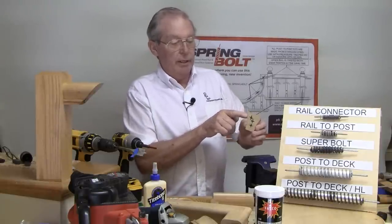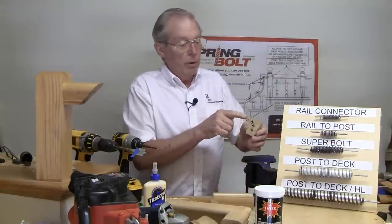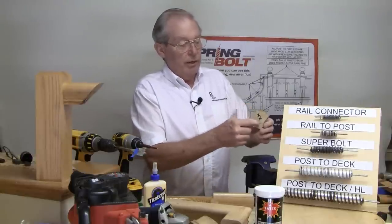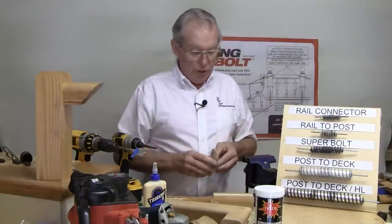This is for doing my right-hand or left-hand miters. You're going to measure in three quarters and down five eighths and make another mark, and then I always drill an eighth-inch hole in the center of each of those marks.